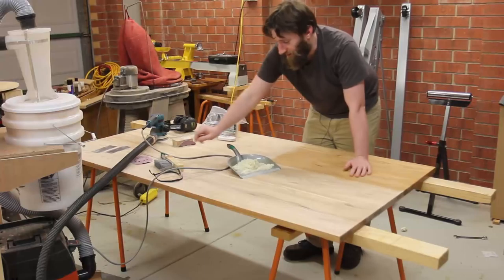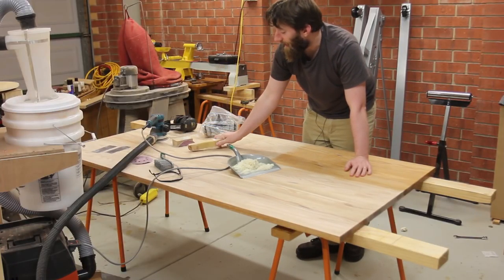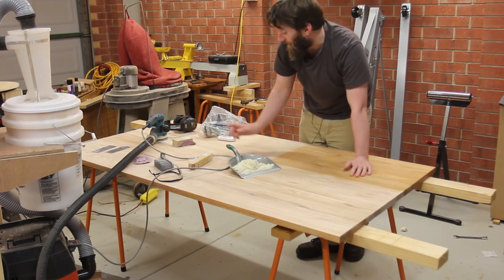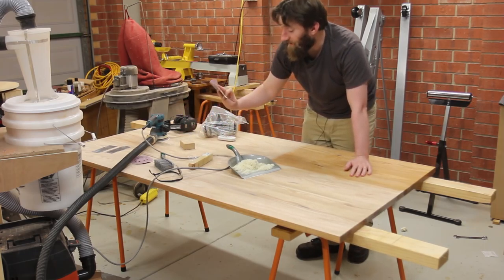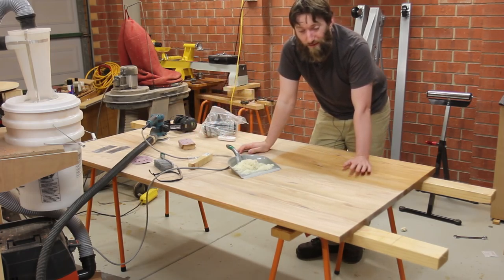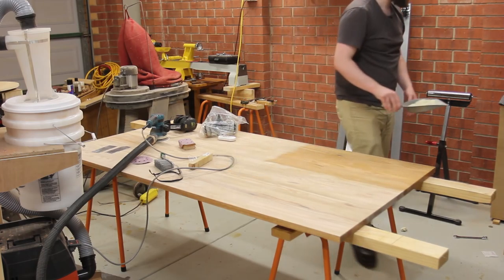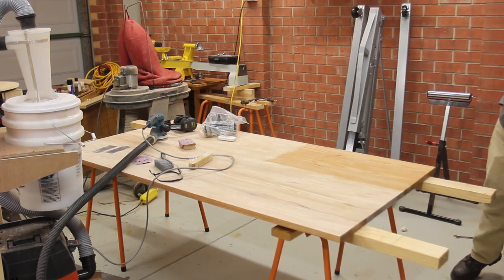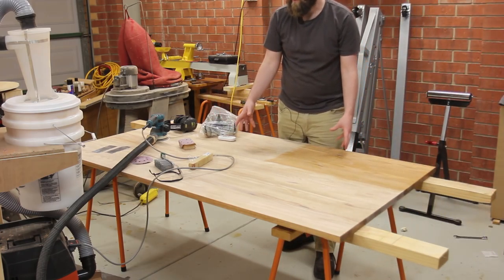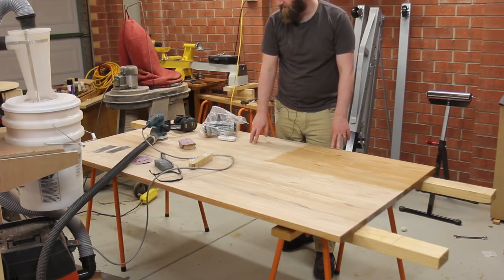It's just sort of an unfortunate thing. You can extend the life of it using these cleaning sticks, and certain brand sandpapers are more optimised for different materials. I found that these SIA discs are quite good with anything that's sort of plastic-y — epoxy works fantastic on it. For sanding something like this, I'd highly recommend a respirator. You don't want any of that polyurethane getting into your lungs — that's worse than wood dust I'd imagine.